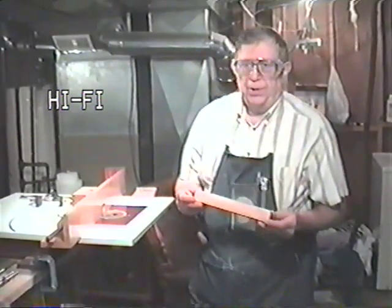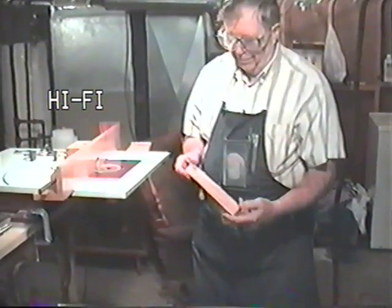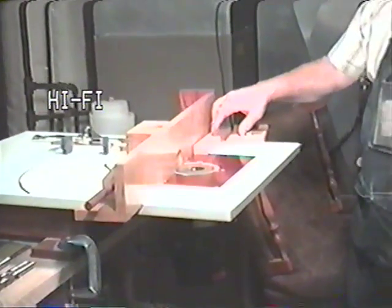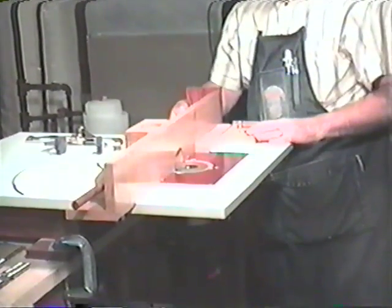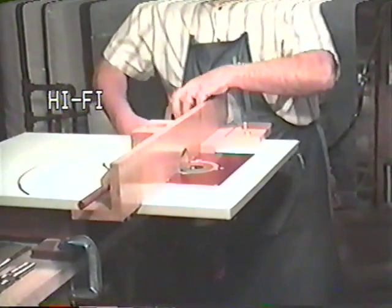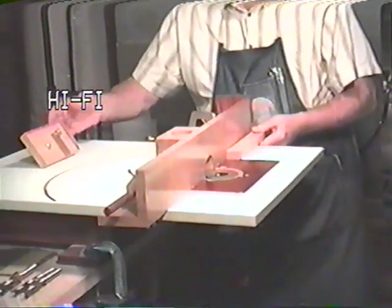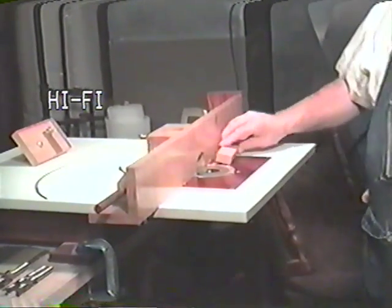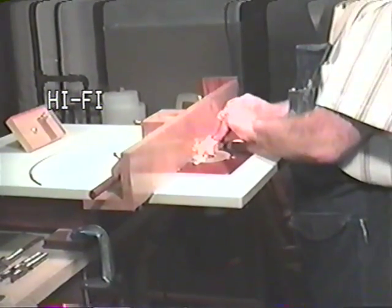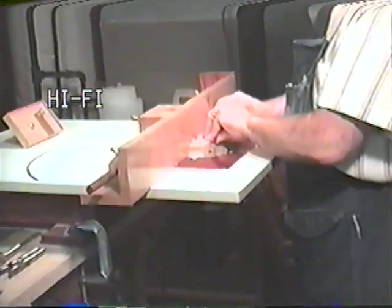Here is a piece that will show you the automatic centering feature. There are no cuts or marks on it. We set it to locate it simply between the locating post and the fence. Snug up the piece against the locating post and clamp the fence. Remove the locating post because it doesn't need to be here when we make the cut — that fence has already been properly located.